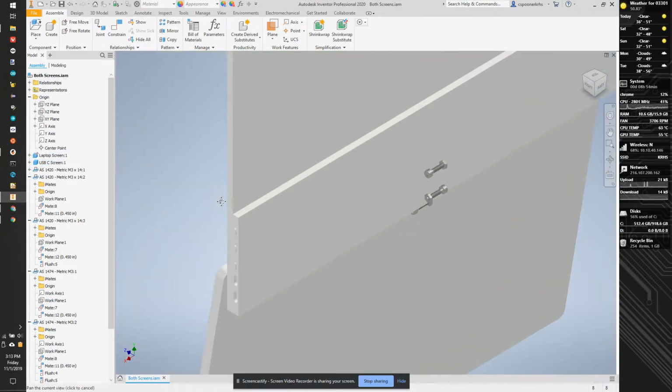Now we're going to place our two parts back in place. Now we are going to have a little more space around here because we just gained 0.15 inches the whole way through. But I have some foam that is roughly 0.05. So if I add it to both sides inside to make the screen a little more padded, it's going to take up that space pretty easily. And I can always layer the foam up a little bit if I need to keep it from sliding too much. So we'll add that in our final steps.